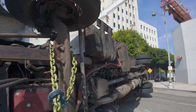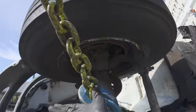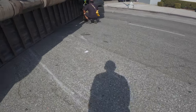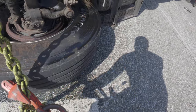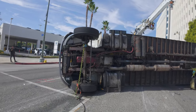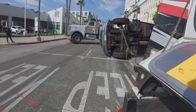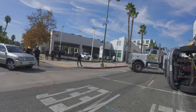These Omega links are so cool because they close themselves — so it's impossible, like on a grab hook, for it to slip out. These are grade 10 half-inch recovery links. We've got to go the distance up here, so right here is good. Quick and easy. I'm only going to put the rear outriggers out since I'm going to use the boom as a catch.